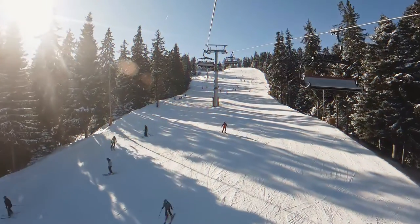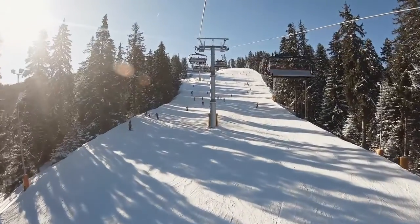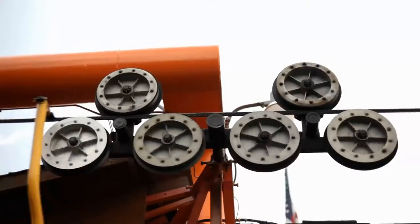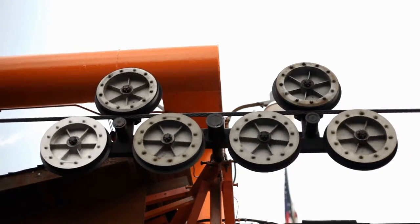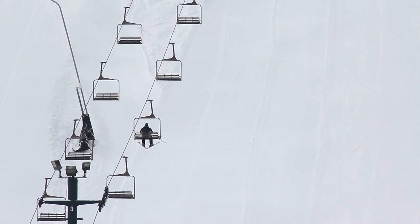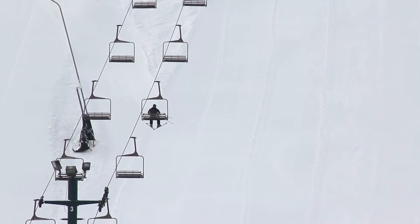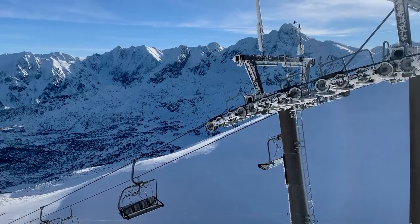Where towers are installed depends entirely on the budget, geography, and weather, and they're installed in place with either a crane or a helicopter. The towers are capped with cross arms that support sheaves, which are basically groups of wheels. The cable can either go above or below these sheave assemblies. For the vast majority of towers, the cable passes over the sheaves, with the exception of when the lift is about to climb a steeper part — traveling under adds tension to the cable, allowing it to achieve a more drastic angle.